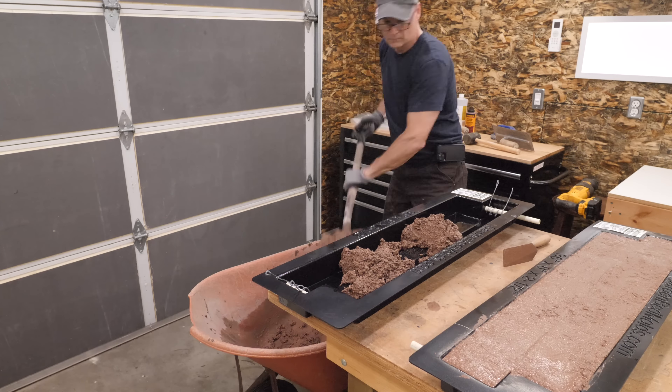After a few weeks, I brought all the castings outside to dress any sharp bits using a concrete rub tool to smooth the edges — if it gets clogged, it can be cleaned with a wire brush. After weighing, I found these panels averaged 22.3 pounds for the 24-inch, compared to 33 pounds for the same panel in regular sand and gravel Portland cement. The 36-inch weighs on average 33.2 pounds instead of 50 pounds for regular concrete. So the perlite panels were 33% lighter and the vermiculite panels were 32% lighter — pretty significant savings in weight. In my previous line trimmer tests, the results were very good; the line trimmer didn't damage the perlite or vermiculite panels at all.